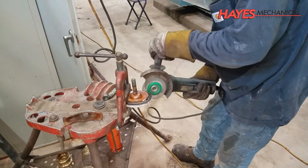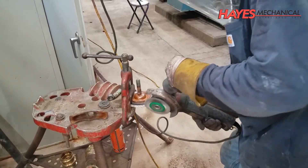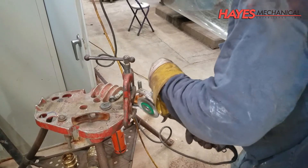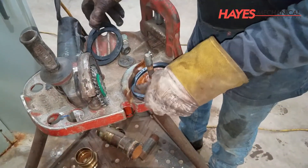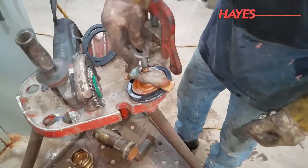After all these maintenance procedures are completed, the boiler is then reassembled with new gaskets, filled with water, fired up and inspected to ensure that all gaskets are holding. All debris generated from the washout is then removed and cleaned up.